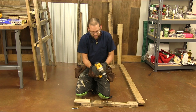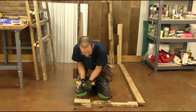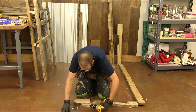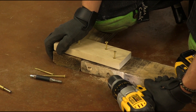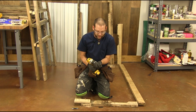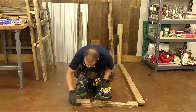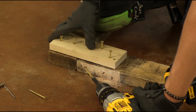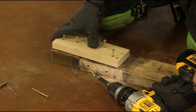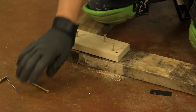And drill in. What that does is it gives me an angled countersink, so then I can go like this and angle in my screw. What it ends up looking like is right here. So now that I've got this braced without a clamp or anything, I just screw my screw in and that sucks up nice and tight.